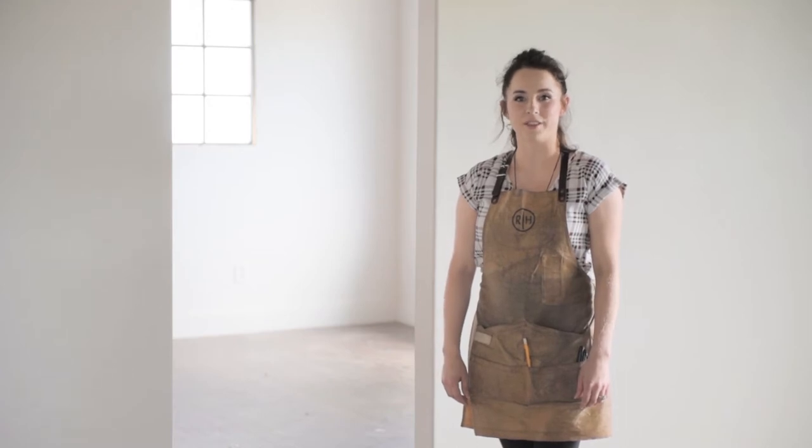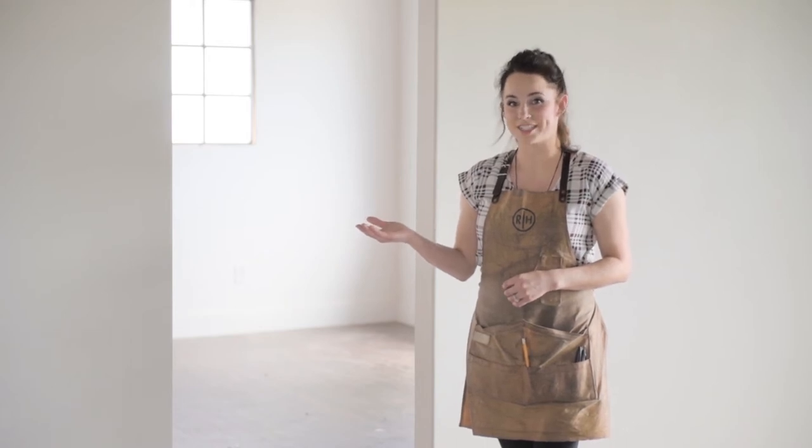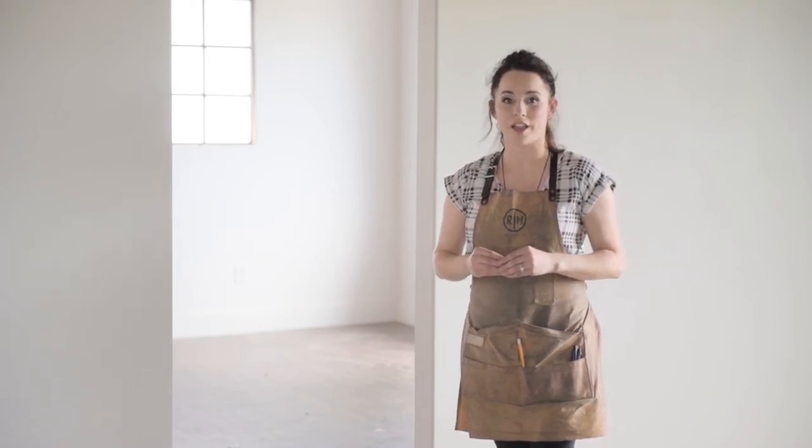Next, we're ready to determine the placement of our header to keep our door centered to the opening. Since my opening is 31 inches and the door is 36, I'll have a good 2.5 inches overlay on each side. Since the header extends 2 inches past the door edge, I will measure 4.5 inches from the opening.